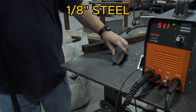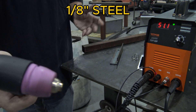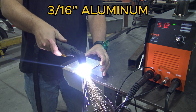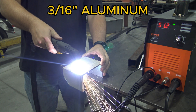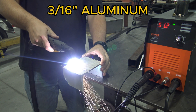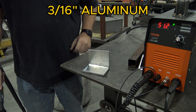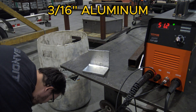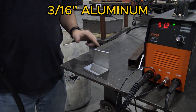You can actually drag the tip directly onto the material if you absolutely need to, even though it's not intended. Next up was some aluminum channel — the top section I was cutting is actually three-sixteenths — and again it cut absolutely no problem. Aluminum is weird because it seems easier to cut when it's thin, but when it gets thicker it kind of gums up. Even the plasma cutters we use at work tend to have a difficult time with really thick aluminum.